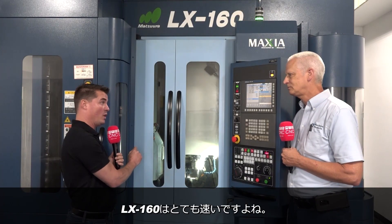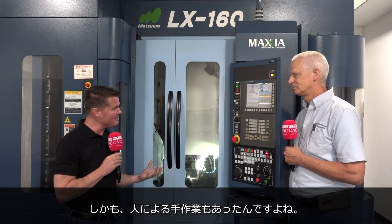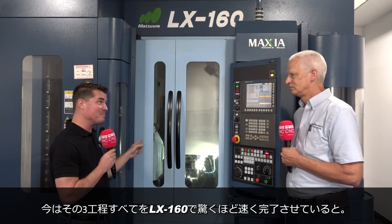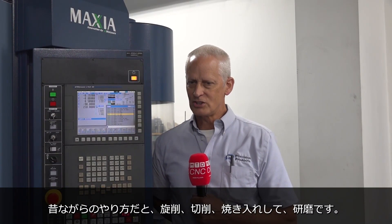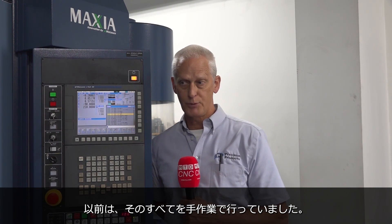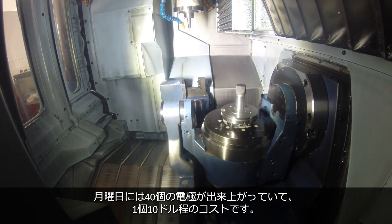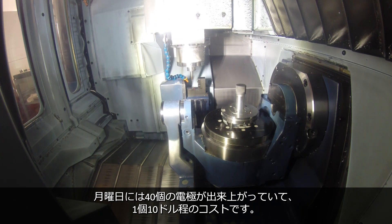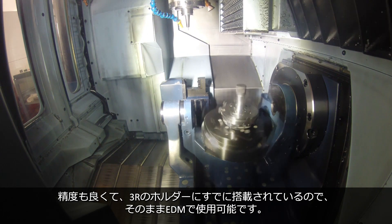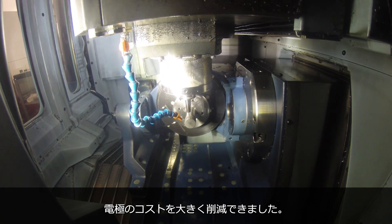This thing is incredibly quick. You mentioned three jobs are now one job — originally you were doing that manually. It's the old school way: you used to make a part round, then mill, drill, or grind it — all pure manual. The electrodes were expensive, over $100 a piece. By eliminating that manual labor, it's almost labor free. You mount the raw material, turn the machine on, come in on Monday with 40 finished electrodes that may have cost you $10 a piece — ready to go, higher accuracy, already on the 3R pallet, ready to go in the EDM. The electrodes are extremely cheap.